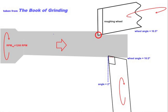Pinch-peel grinding is kind of a funky type of grinding. When you do regular cylindrical grinding — let's say cylindrical traverse — your wheel's like this, this guy's rotating, we cruise across. In pinch-peel, kind of like in the figure here, we have a finishing wheel down below, but we have the roughing wheel, and we angle them way over this way. Then we come across the wheel, this part this way, while the part is rotating real fast. Now, this is very different from typical cylindrical grinding.